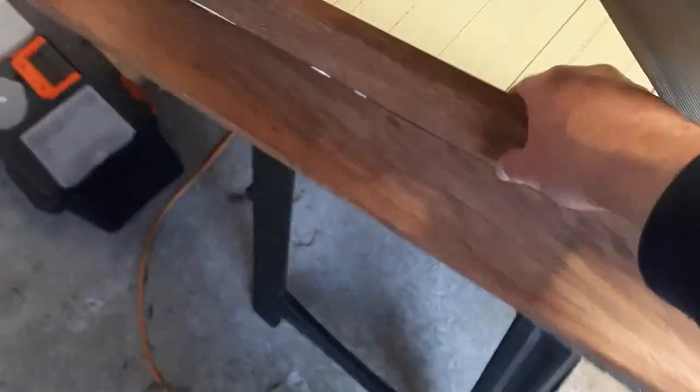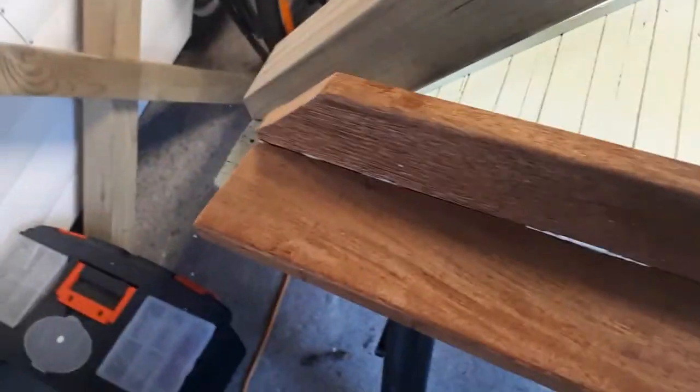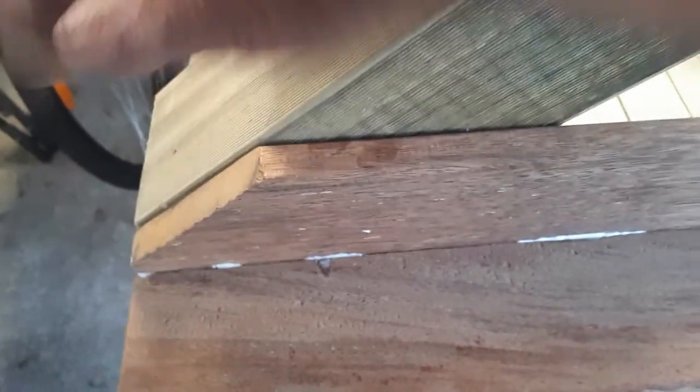Okay, here it is now. I've got the legs sitting on the table. I've made this L-shaped angled wood. Fits on there. Cut 45 degrees off the corners there. What I'm going to do is drill that along here, screw that to it, a hole right through there and a hole right through there and put some bolts through.